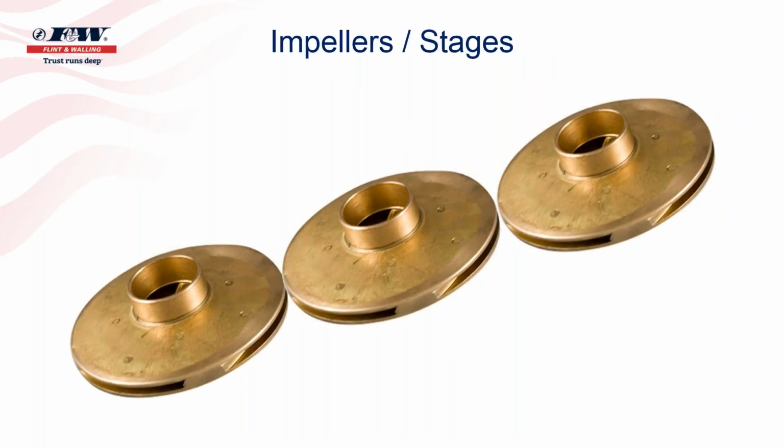The other thing I'd like to say on impellers is that a lot of these centrifugal pumps are referred to as a single-stage pump or a multi-stage pump or a two- or three-stage pump. I want everybody to understand that when that terminology is used, a stage is referring to how many impellers are in that pump. So if you have a two-stage pump, that tells me that there will be two of these impellers that are inside of that pump.